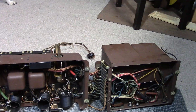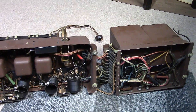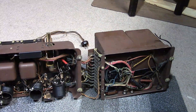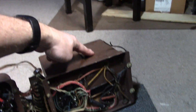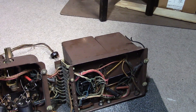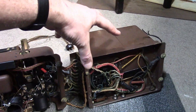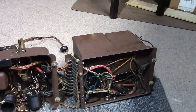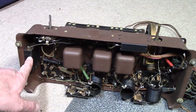As for the power supply, it looks mint. I'm not used to seeing wiring still showing the original color so prominently. I actually have two of these already — this is my third — and on the other two you cannot see the color of the wires like this. That's brilliant, and it's handy because the service info refers to wire colors. Now I'm really curious: does it work? This is probably from 1929. It might be possible — this radio does not use electrolytic capacitors; they are metal foil, wax, and some kind of paper. I've taken one apart doing the Brunswick and they're huge — something like two microfarad. Most of the B-plus filtering is done by huge chokes, so we have three big metal boxes: the power transformer, filter chokes and output transformer, and the capacitors.